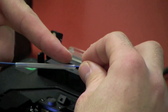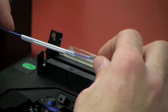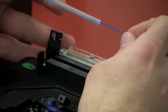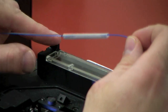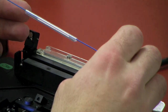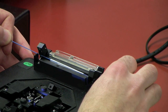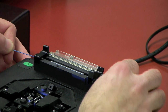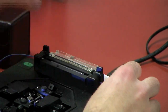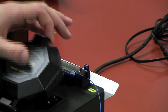So we want to have the 900 micron coating inside the splice sleeve on equal size on both sides. With the heater closed, we're going to open the heater, both clamps, and lay the splice sleeve into the clamps — and they automatically shut as soon as you lay it in. You have to push down the other one. Close the lid and close our wind protector.